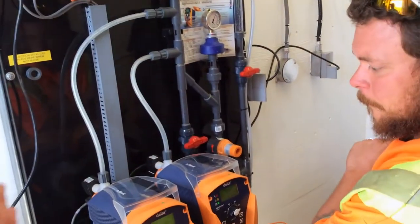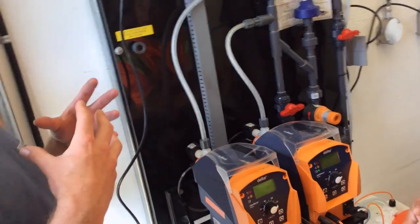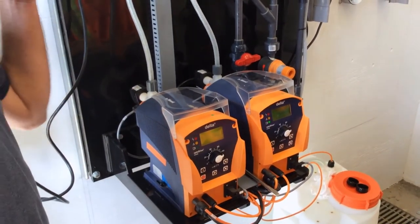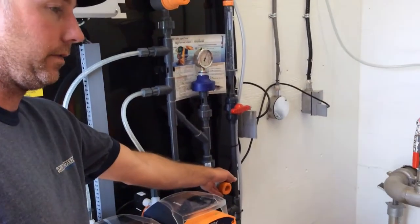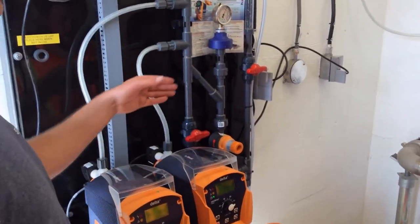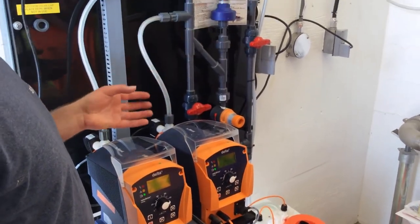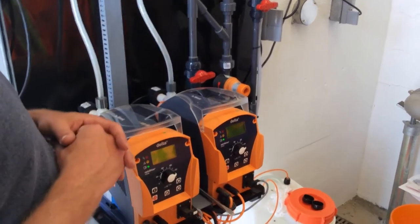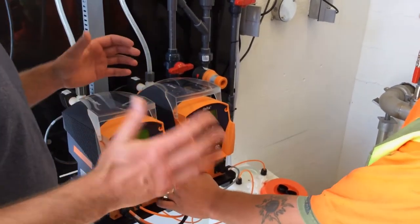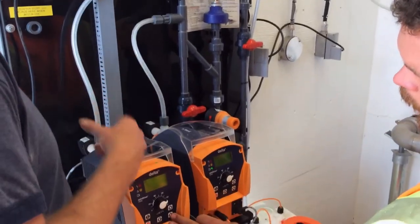So the one thing I'm going to do, because it looks like it's going to work, is set them both at pressure setting 2. Now, in the short term, if you intermittently or randomly see that P plus come up and nothing really is showing, we might have to go to P3. But I'd rather put it at P2 because when I start going through the pressure relief, it gives me a P plus alarm. If I go to P3, that won't happen. It'll go through the pressure relief, but it won't necessarily get an alarm. So what you'll see is low chlorine rather than an alarm for the pumps telling you that's happening. So I'm going to set it at P2 for the time being, but there is a chance that you might get nuisance P plus alarms in the short term. If you do get that, either call me and we can go through it, or switch it from a 2 to a 3.